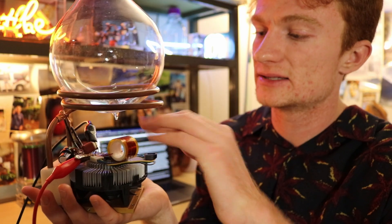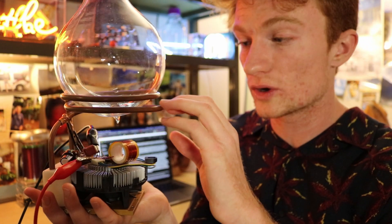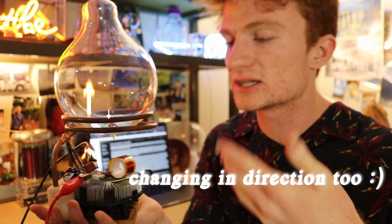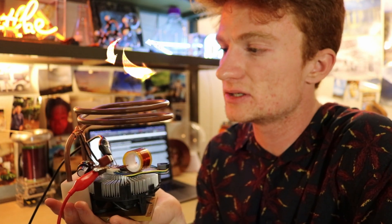This is the coil I was talking about. This is the oscillator circuit that switches current back and forth through these coils. Since there's changing current, there's a changing magnetic field around these coils — changing in strength constantly. And since that magnetic field is constantly changing, it's going to create another electric field of its own, and the shape of that electric field is going to be in a ring. I thought it was the magnetic field in the last video, and that is just wrong.